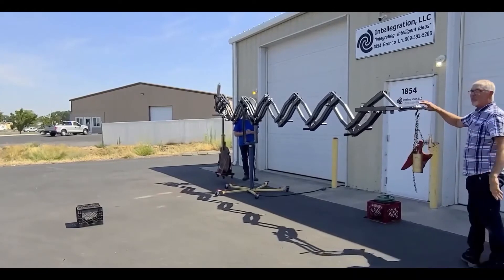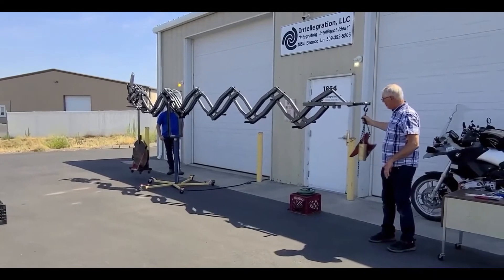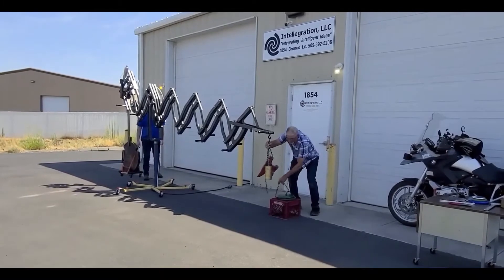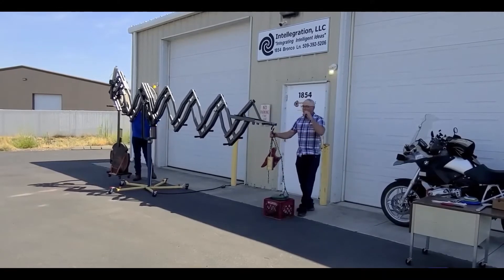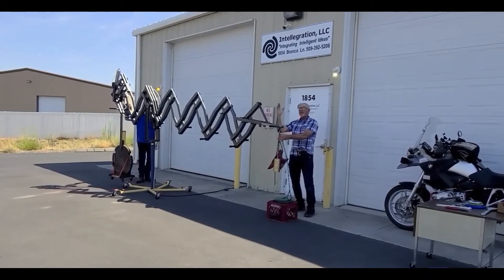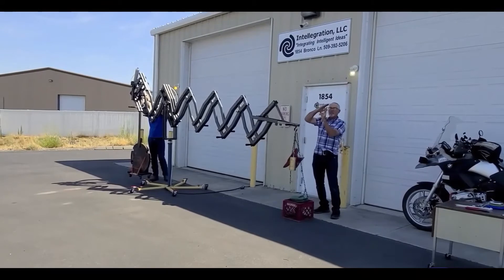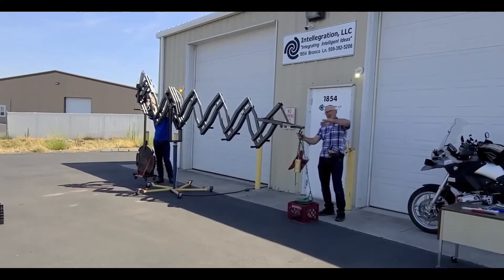There's a slight difference in the balance when it's extended or not. In normal operation, you've got it in the unloaded configuration, so the first thing you're going to do is bring your vacuum cups down, grab your load, activate the suction cups, and then change the counterbalance at the other end. Right now it's in the no-load end and Derek is going to switch it over to the load end. There are two pneumatic cylinders — one locks the position into either member A or member B, and the other one actually pushes the cylinder.